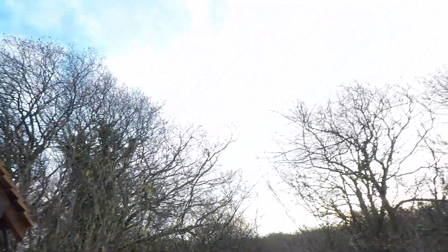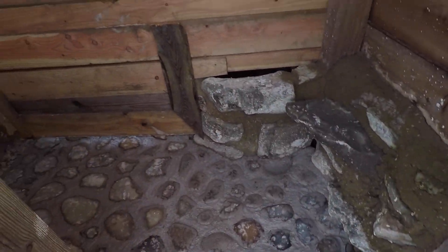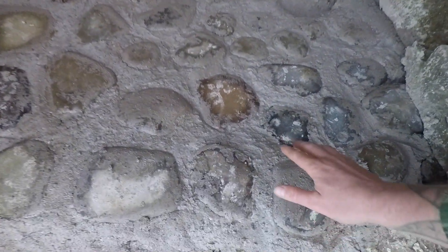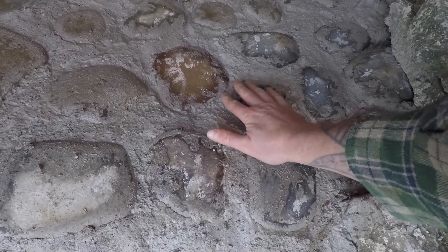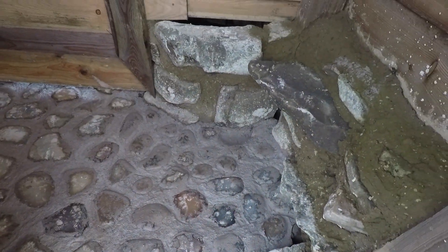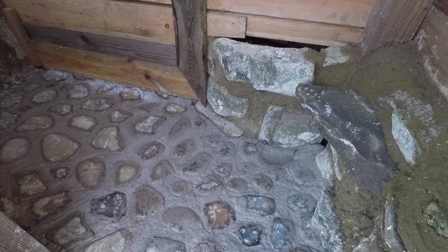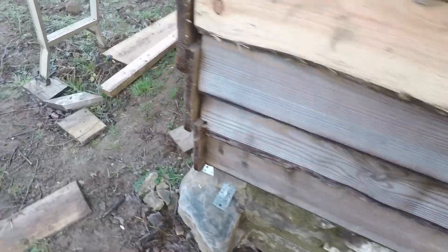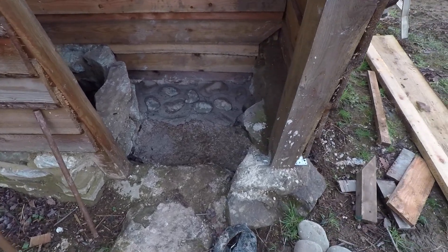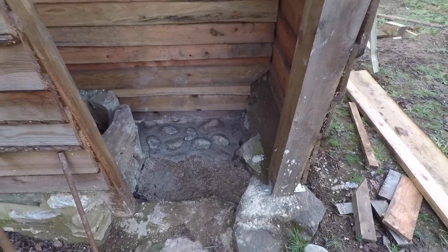Okay everyone, new day - nice day too. The floor is hardening slowly because it's lime, it does it slowly, but it's looking good. You can see it's still soft - I can pat down the little lumps and still move it around a bit. We're getting minus two temperatures tonight, so I'm a bit concerned about that and I'm going to have to cover this up. I'm going to get this side over here done because I just want to get it finished, and then I'm going to cover it up so it doesn't get frozen. I've only got this little bit here to do, so I'll get it done and cover it up.